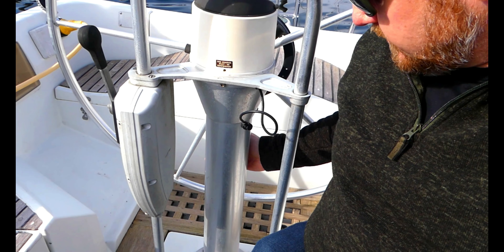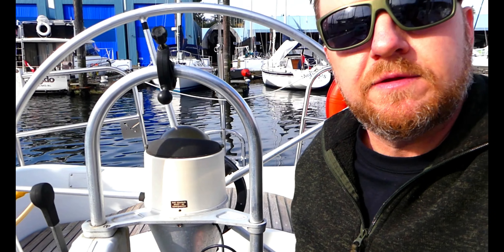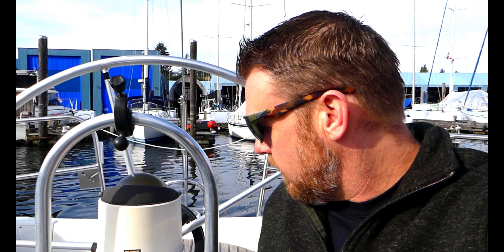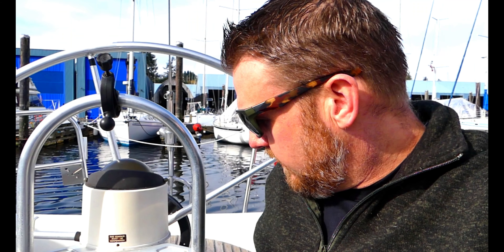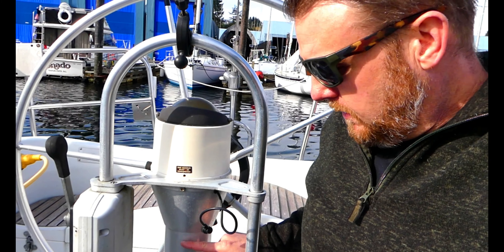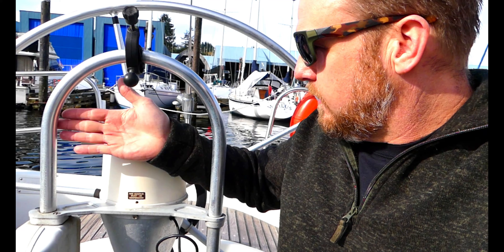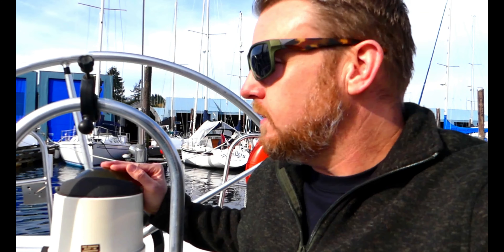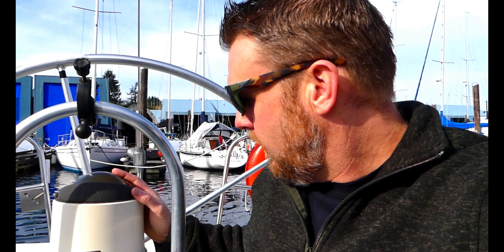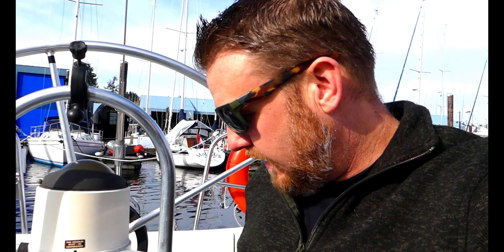To get the plotter mounted, I'm going to have to get the cables up through the tube on the binnacle — that's the best way I could figure to do this. I'm going to open it up to make sure there aren't too many gears, chains, or wire rope in there that could hang up on the cables or seize the steering, which would be equally scary. I'll cut a hole down here, free-air the cables into the back, put a plastic panel, and mount the plotter facing up so you can see it from the helm. I want to get this compass off — it's sun-damaged and you can barely see through the fog — then fish the cables up through.